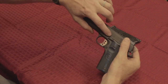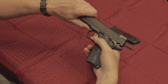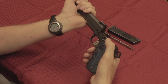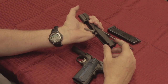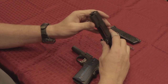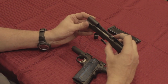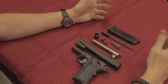Now that the tension's off, you're going to slide that back and line up the small notch with the end of the magazine release, then push the tab from the other side so it pops forwards — take it out, set it down. Now the slide can come forwards. Here's your steel frame and grips. The guide rod is short, not full length, so just catch it in your palm. Turn the bushing all the way to the other side so it can come out, set it down, put the keeper forwards — and there you go, your Colt Competition disassembled.